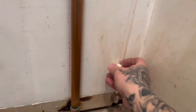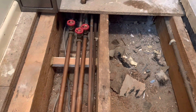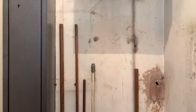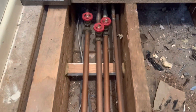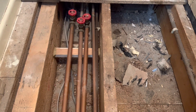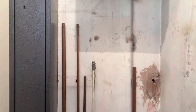Drilled the new hole for the condensate — 32mm. Took this board up. So my options are the easy way: connect straight onto them, but that'll look rubbish. So I'm probably going to lop them all off here. That's our gas, which will need capping — 22mm over that side, straight from the meter. So I'd have to tee off that and come across. I think I'm going to lop all these off here and come straight up to the boiler so it looks neat.